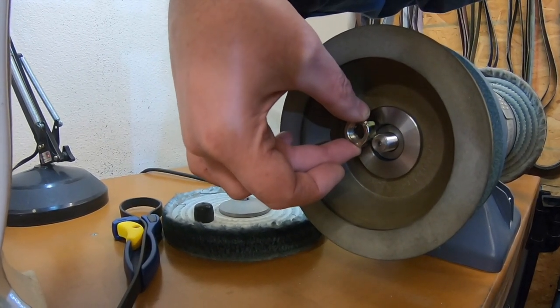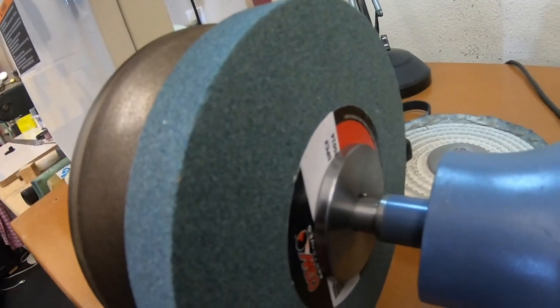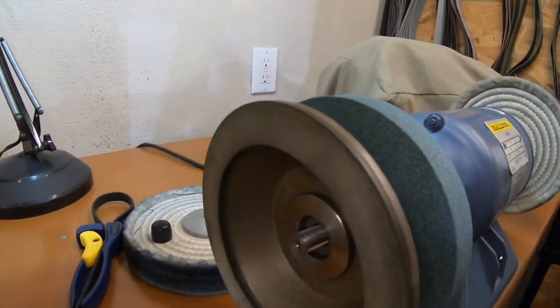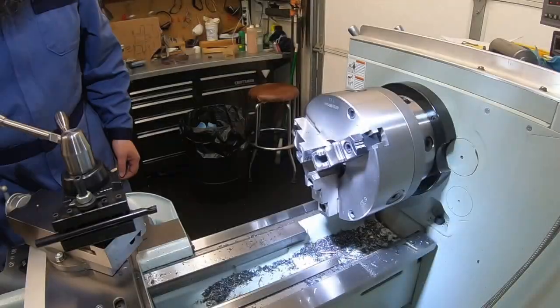and then we're going to add another 3/16 inch of thickness out here. So we should still end up with plenty of room for the nut to go on. We just got to notch that out to get over that keyway back there. But yeah, looking good. Let's get it back over to the lathe and let's get part number three made. Then we'll get on the mill, notch it out, and we'll be ready to bolt this thing all together.